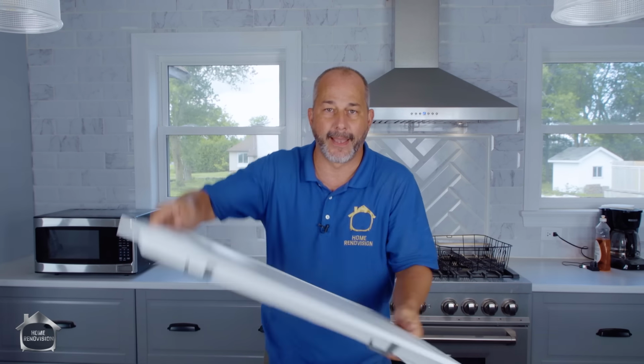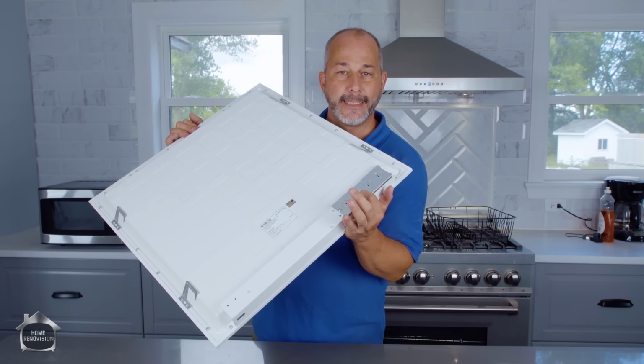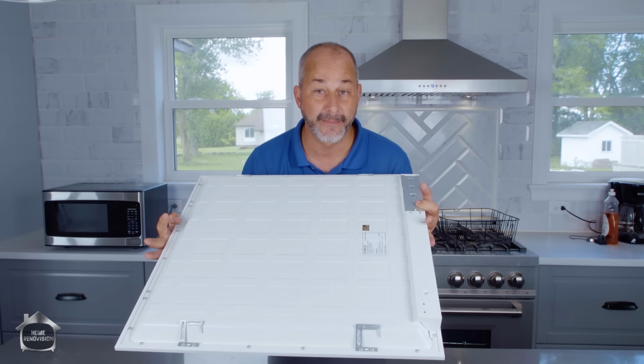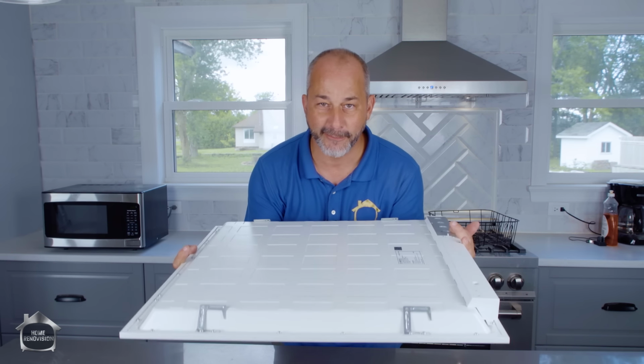Black to black, white to white, make sure to secure your ground, and you're good to go. And once you've done that, consider the option, see all these extra ports? You can connect even more and more and more lights in your basement, and then you can change your switch to a dimmer because this new technology can be dimmed as well. And then you've got all the light or all the sexy comfort that you're looking for in your family room.